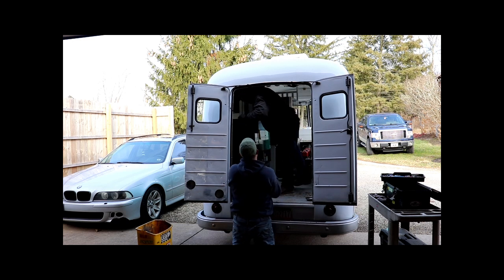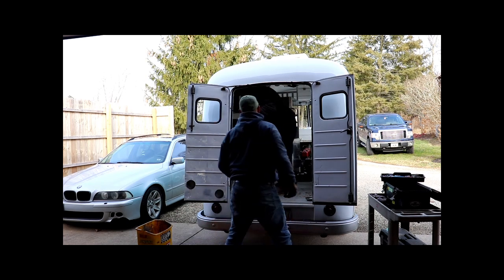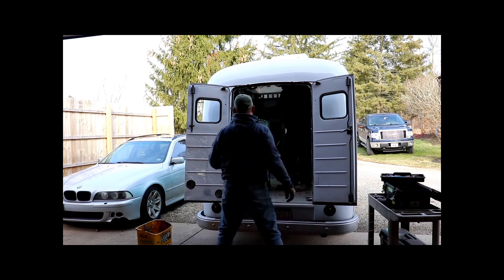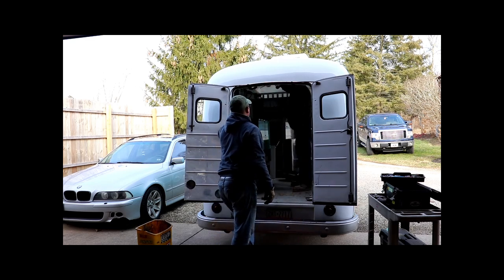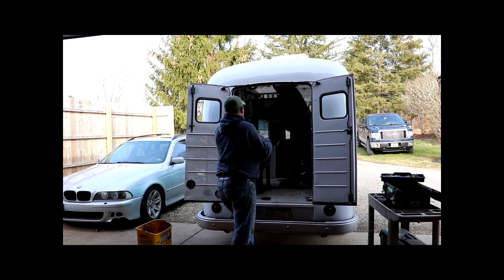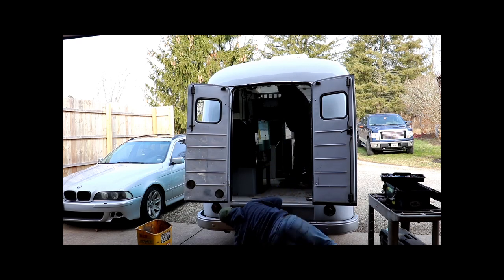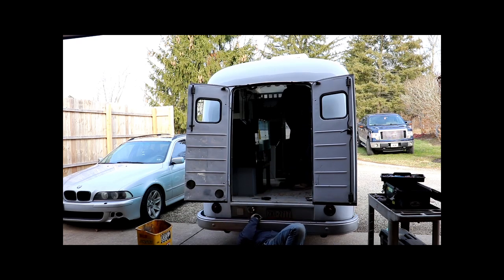Well, I have all the specs on this, plus the new equipment that's going in. But listen, you're not going to draw 50 amps at one time. This thing, when it's running, it's going to draw some power, whatever else he's going to have. It's not all going to run at the same time. And actually, I have the amperage load of all the equipment. Most of the highest ones were like 12 or 15. They're not all going to run at the same time, even if you got two people in here doing two different things. If you went off of what you had on specs, dude, your panel in your house would be huge.